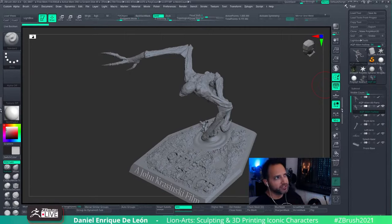But in the Form 3, you have an inverted natural peeling effect, because the light processing unit, the LPU, that has a laser and everything, wipes across the bottom of a flexible, clear-bottom tank instead of a hard, rigid glass or plastic tank base, which was the original Form 2's design. And the Form 1 as well.